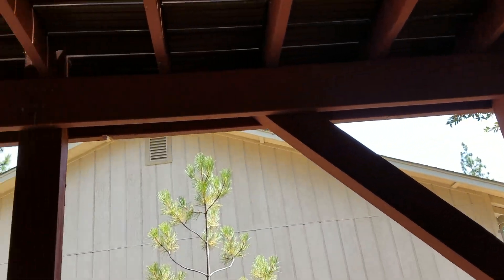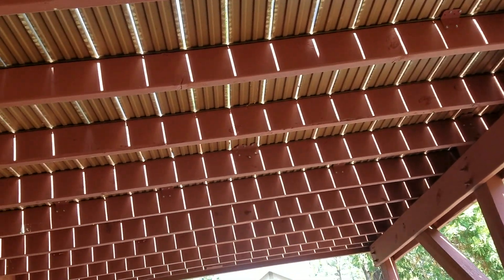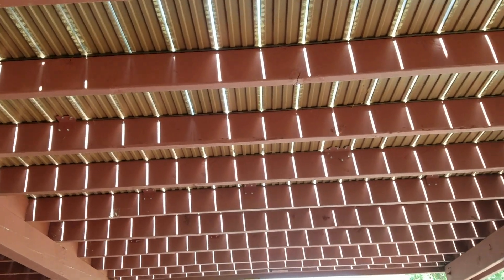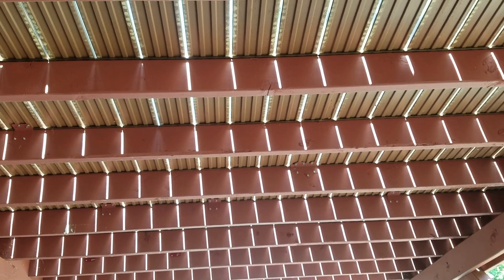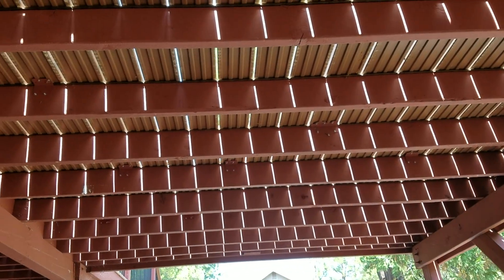Make sure you look at the bottom of the joists and then the tops as well. The top of the joists is where you'll get all the wear from the water sitting underneath it. That's why this composite wood is pretty good — it has those ridges underneath and it allows for air to go underneath, so you don't have an entire piece of wood sticking on top of a joist and rotting out your wood.